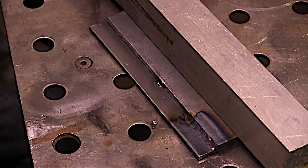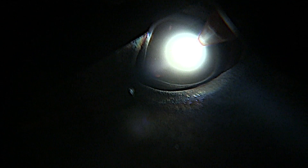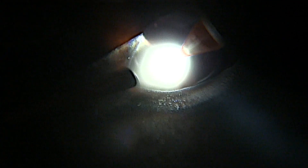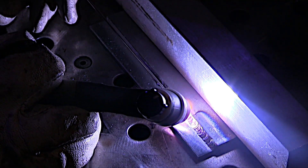I'm going to light up on the center of that thing with a nice fresh sharp electrode and try to get that puddle grown within three seconds and get moving. Here's a close-up look — light up. One, two, three, and move and go. And that's really all there is to it. Here's a slow motion: light up in the center of the puddle, increase the puddle by pressing the foot pedal until the puddle matches the previous size, then move and dab just like you're resuming your travel speed. We'll take several more looks at this because I'm going to stop about five times on this little six-inch run.